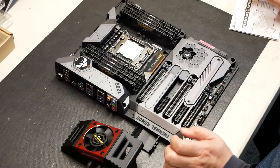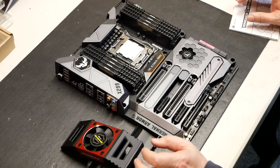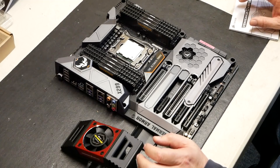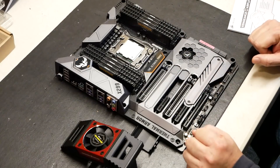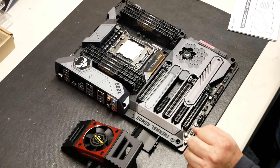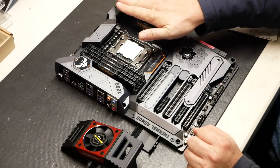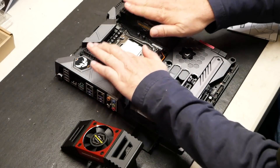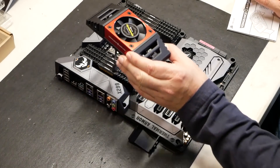That's all fine and dandy. You've got to remember, on this board — the TUF X299 Mark 1 — I'm only talking about this specific board. For this specific use case, there are some chips that go on this board of a previous generation that only support one four-channel lane. This chip supports both, so they give me two of these to install.